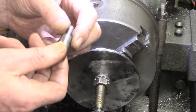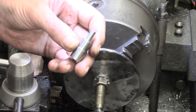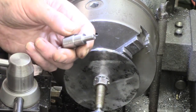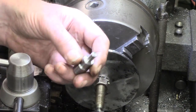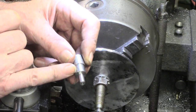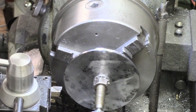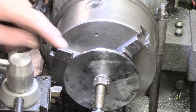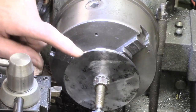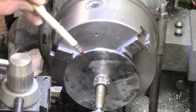Because I've already made this little stepped piece, which goes into the rotary table centre — smaller diameter, larger diameter between the T-slots, and this goes into the back of the chuck. So it's a little bit tedious, and hot rolled steel — hate it. I just haven't got any cold rolled plate, which is annoying. You get sparks from this stuff.